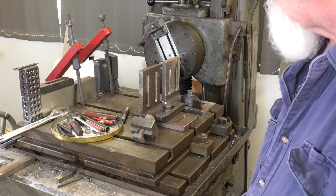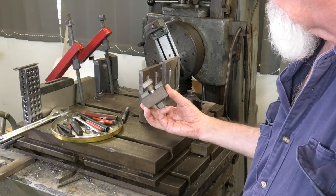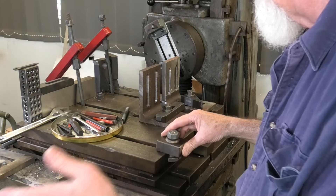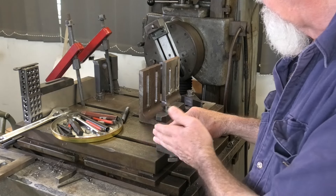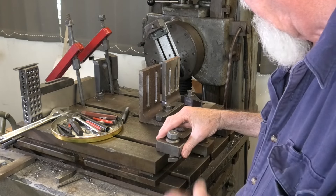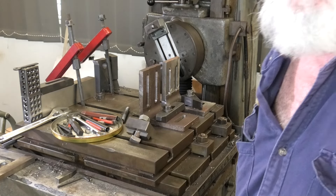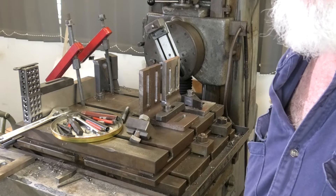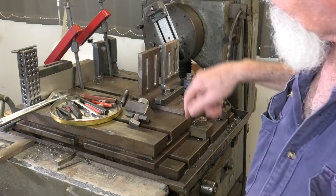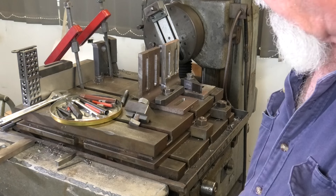This is one of the squaring blocks I spoke about earlier — and you can use this idea on any milling machine. A really robust piece of steel that fits neatly into the T-slot; you can bring your work up against it and it's going to be parallel to the slots. Or you can use your square off the back, put two of these up, and bring your vice or workpiece up against the stops — so extremely rigid and very quick for setup. If I just lift the camera a touch, you can see one of the V'd out sections in the table — so if you rotate 90 degrees, the side blocks just drop straight into the V section and you're accurate.